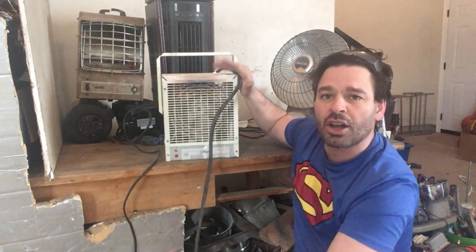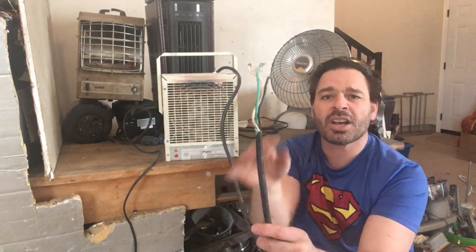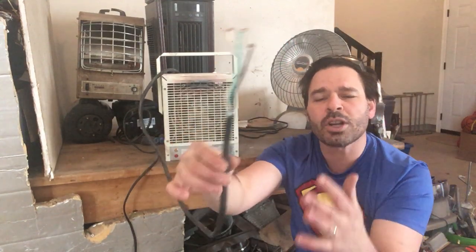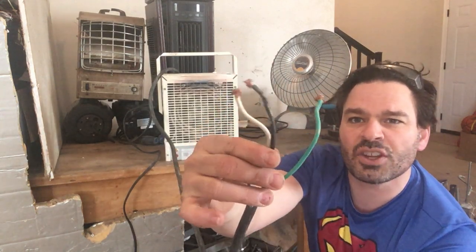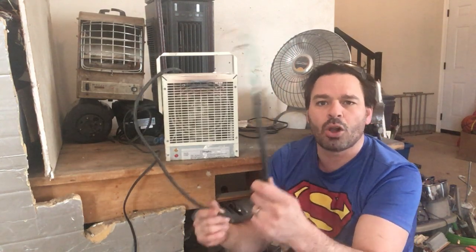The reason I wanted to show this one is because this one has an interesting wire. It does have a nice shell of tin that's going to give me eight cents a pound. But this wire — there are right now categories of appliance wire at the scrap yards: 40% appliance wire and 60% appliance wire. This wire as is, if I was to bring this in, would be classified as 40% appliance wire. The rule at a scrapyard is they will look at plastic-to-copper ratio and copper recovery. This is currently going for $1.35 a pound in London, Ontario.